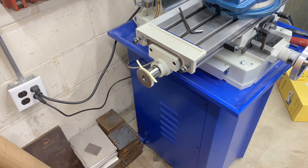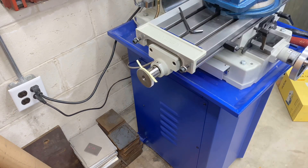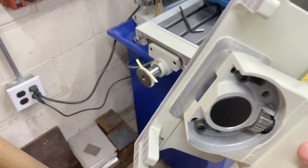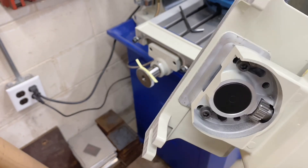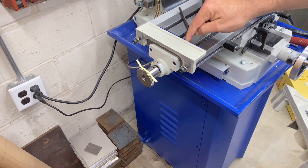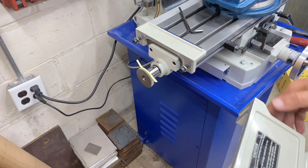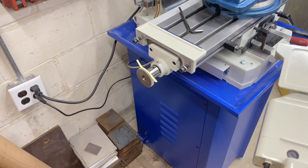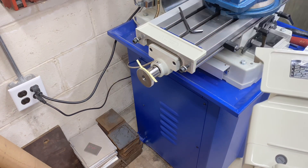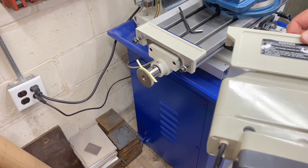Off camera I did a pre-installation and got it set up so the round tooth is not hitting on the housing — it's equal distance between both sides. I went ahead and tightened those two screws. Everything is lined up in this direction because of the dimension I took, and I can set the up-and-down clearance between the gears with these two screws. I'm using a piece of paper, which is about three and a half thousandths — I'll try it there, since four thousandths is what most people do.